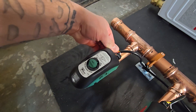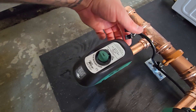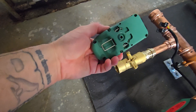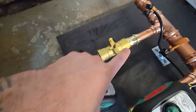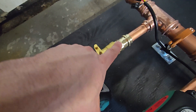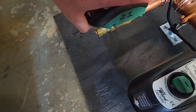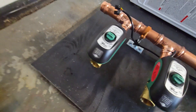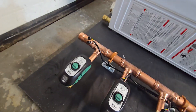These are really nice because if you ever need to replace one, you can pop off these connectors and press the little clip in here to pop the actuator right off and swap the unit. Obviously if there's something wrong with the ball valve itself you'd have to replace that. I put threaded fittings on here so that ProPress connections would not have to be cut and redone. The customer is also going to be provided sweat fittings that will thread in here, since he wants to do sweat for the rest of the run up to the baseboard.